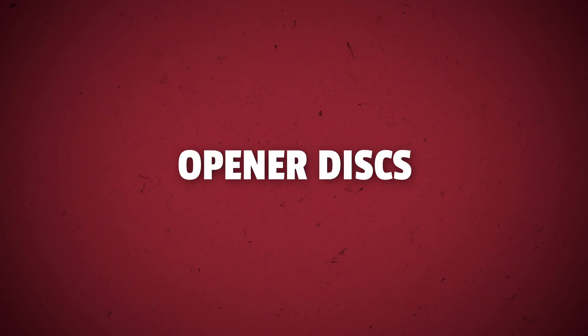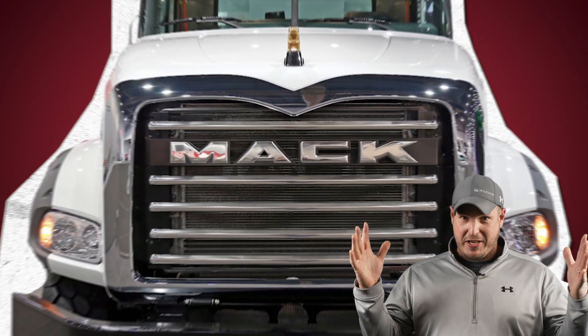While you've got those gauge wheels off, grab a tape measure and a few business cards. We need to check the diameter of those openers to make sure we don't have a gap big enough to drive a Mack truck through there. Just insert the business card on the top and the bottom and measure the contact distance between them. A general rule of thumb would be an inch and a half to two inches long.